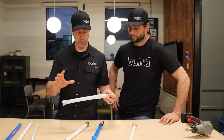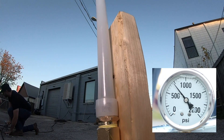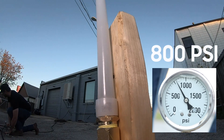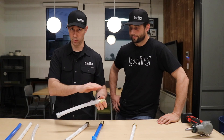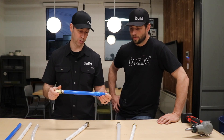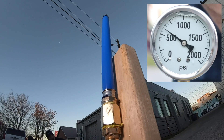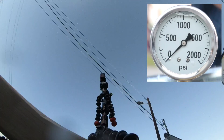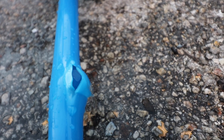We think the Uponor was around 500 to 600 PSI. Well, it was over 600 because we started with the 0-to-600 gauge and had to switch out to the big gauge that goes up to 2,000. So it's over 600 but didn't hit 850 — somewhere in there. We'll put that number in the description once we look at the edit footage. Next up, we put the Viega in because that failed second on the previous test. Very similar — it came up, and then you started feeling it rupture. Interestingly, you can see where it starts to rupture in two sections, splitting like a stalk of a corn plant. It got higher than the Uponor but didn't hit 1,000 — so around 850.